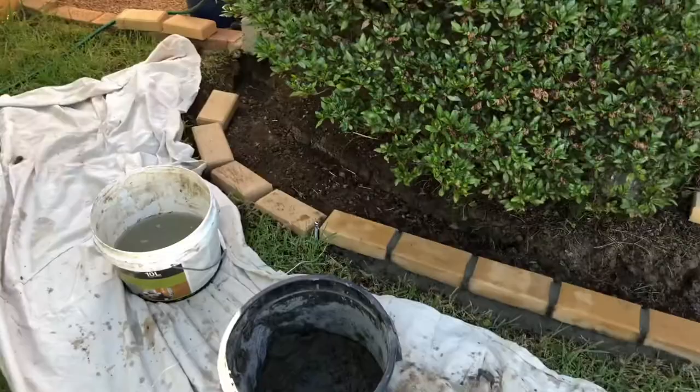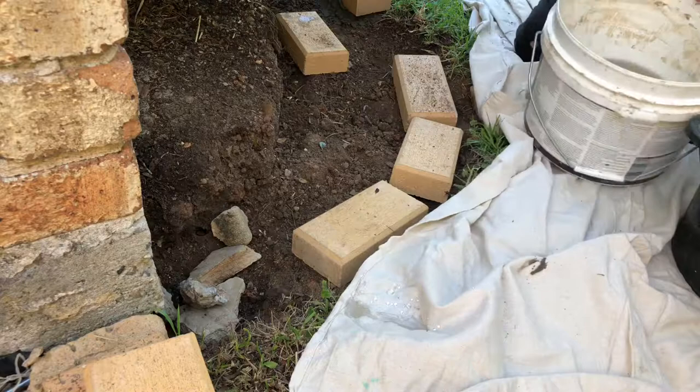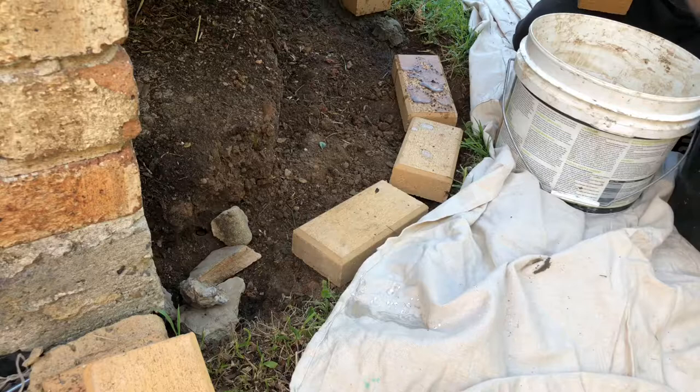There's the run of five or six pavers looking good. Next is a curved bit — curved bits are a little tricky getting your spacing right. You can cut a paver in half but that doesn't always look great, though sometimes you have no choice. I like doing curves and find them fairly easy, but you can't use a string line. You just have to work out your starting height and finishing height, then get it to flow consistently from one to the other.